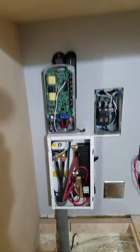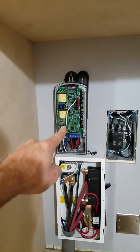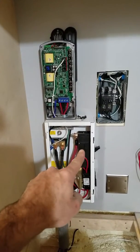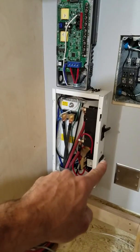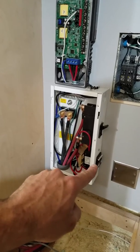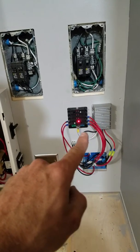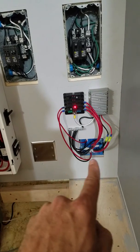Now on this side — we are in a little closet, it's going to be the wardrobe — we've got the Midnight Classic 150 charge controller, a Midnight DC enclosure that's got our main breaker and then a slew of breakers for the solar coming in, then coming out from the charge controller to the batteries, and then another breaker that runs over to our 24 volt to 12 volt step-down converter, which feeds our 12 volt fuse panel. All of our 12 volt circuits come out of the wall here.